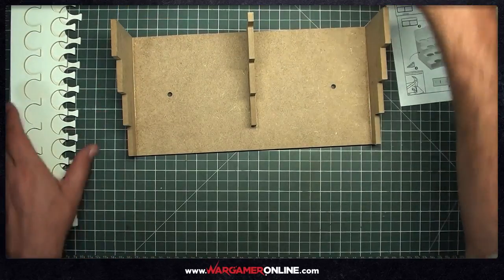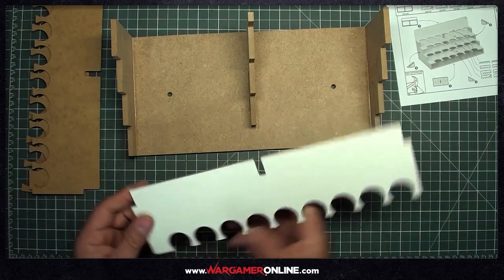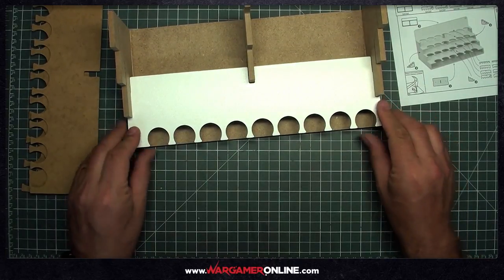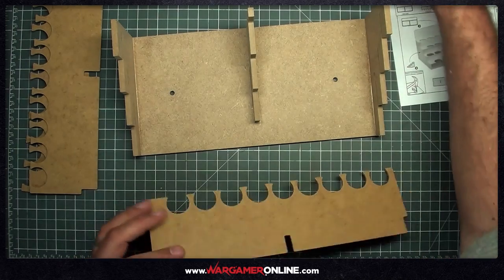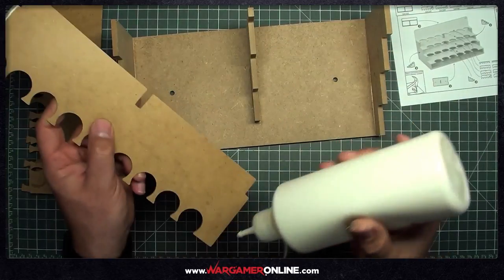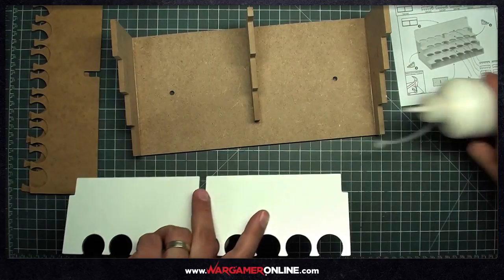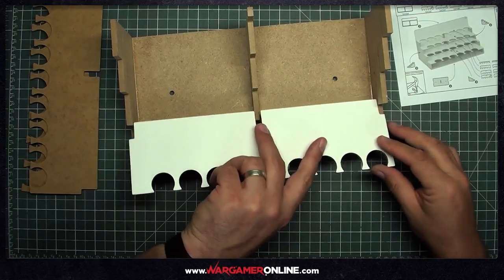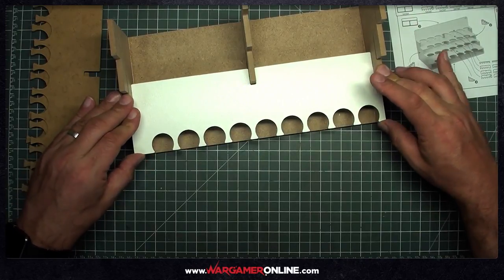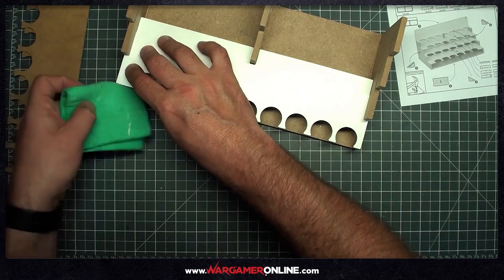Next up, we need to position the bottle racks — start with the largest one at the bottom first. Quick dry fit into place to make sure everything's okay. Now apply glue in three places along the edge strips — each side — making sure not to go too far in, and just a little for the central support. Now slide it into place. The key is to keep the surfaces from meeting until the last second so the glue doesn't get squished completely outside — sliding it in at an angle minimises excess glue.